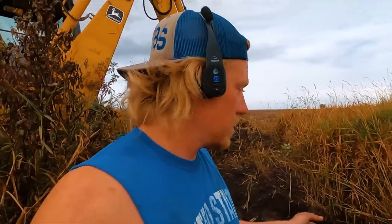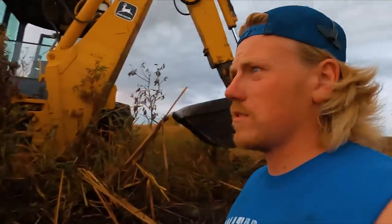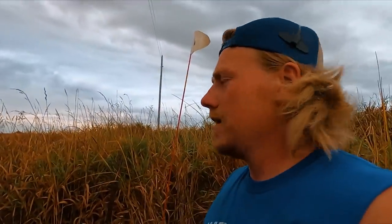I've seen a lot of outlets that have perforated tile right up to the end — they're jammed full of roots. So cleaning the actual outlet isn't going to do me much good because upstream is plugged too. But this one looks okay — they did put in about six to eight feet of non-perf tile, then switched to perforated. The edge of the field is like 40 feet away, so they didn't do enough non-perf, but it helped keep the roots out for at least some of it. It's getting dark and I've put enough hours on this backhoe for the day, so I'm heading back to the trailer.